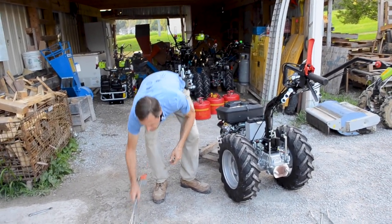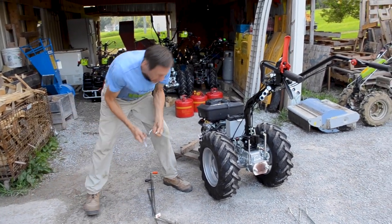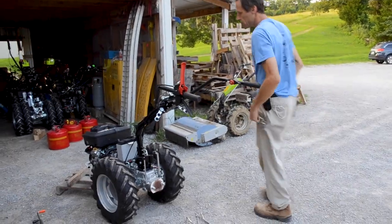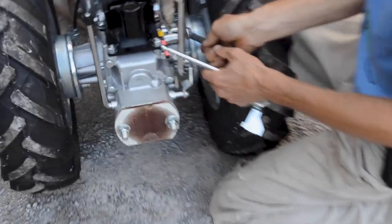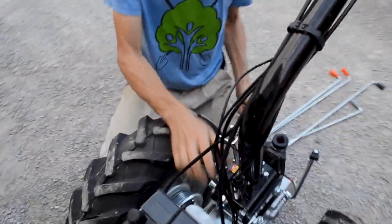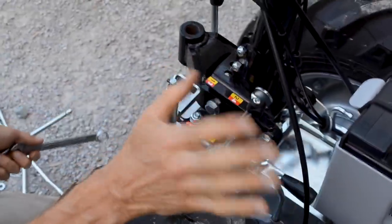One more thing. This gets a little more complicated because not only are we going to change the shift levers, we have to change the gear shift selector lever. And this is for safety reasons, because of the gears in this thing, particularly high range fourth gear. If you're in fourth, with the gear lever in this position here, you're in high velocity and you're moving this way. Fourth gear is about 4.5 miles an hour. So it moves at a pretty good clip.